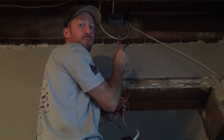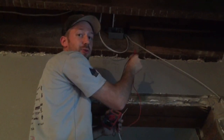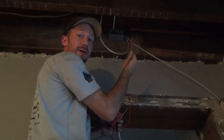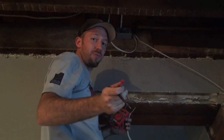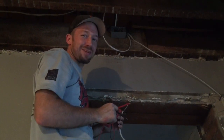So now I know how to wire this box. I'm going to hook up the hot to black and the neutral to white, and move ahead with the new wiring. Stay tuned for more updates and helpful tips. Subscribe and like — we'll see you next time on Spirit of a Handyman.